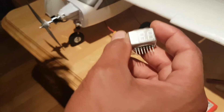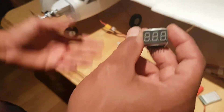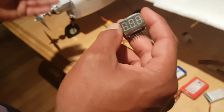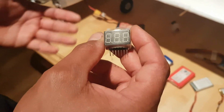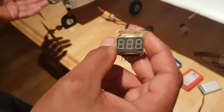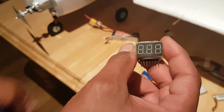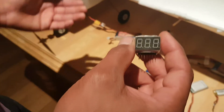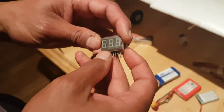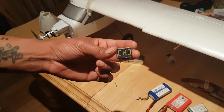You never really know how much time you have in your battery, so you can run the battery for however many minutes you think you can fly, check your voltage, and monitor it as the voltage drops. This way you never over-discharge your battery — you keep it at a safe level where it can be recharged with the same milliamp hours it had before. As everyone who flies knows: if you treat your LiPos well, they'll treat you well. Over-discharging or charging too fast means you won't be able to put as many milliamps back in as before. I recommend it — everyone should buy it.